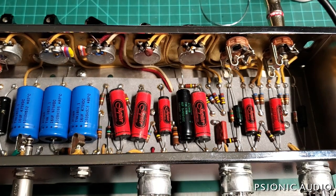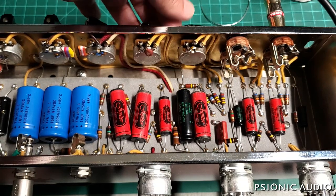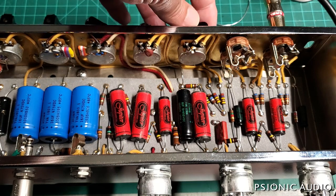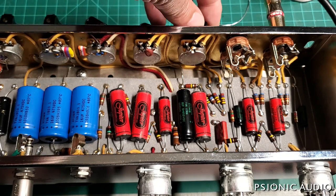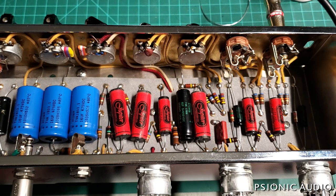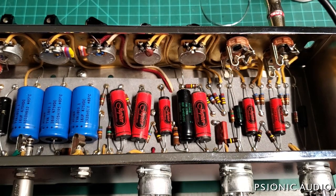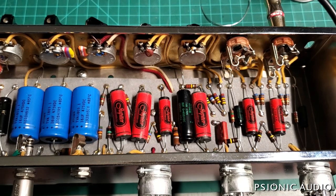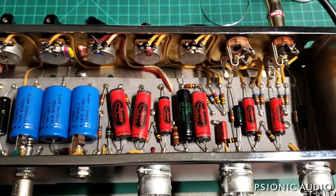He may want the linears, which is how the old ones would have been. You can work around it — you just don't have the same control throughout the entire range of the pot. The audio taper is actually nicer for most people who want a lower volume, because that's really hard to get clean with a linear. There's also a kind of tearing paper sound in the background at higher gain on this amp, and I suspect that DC there is the cause of that.